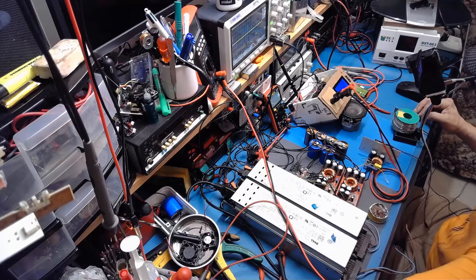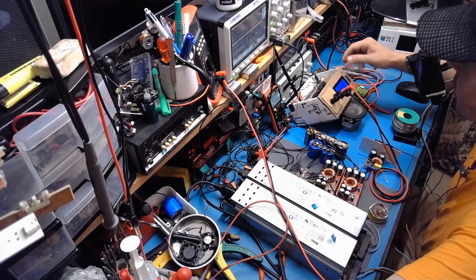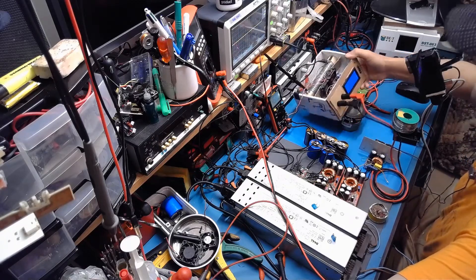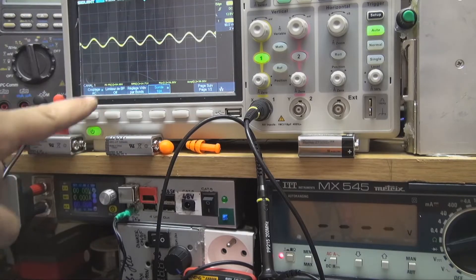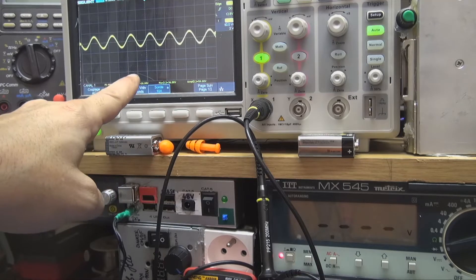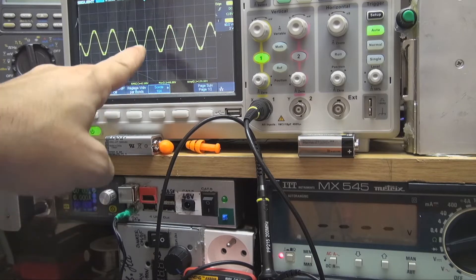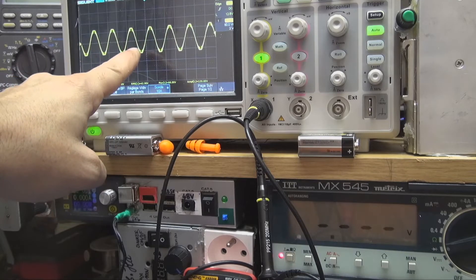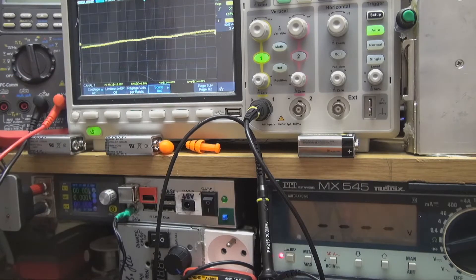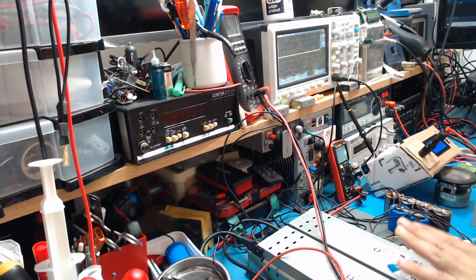To reset, decrease the sound. The heating element — the load resistor — is very hot. You can see the signals on the scope. Going to tell you how much power it is: 100, 200, 470 watts. You can see some distortion. You are at about 60 volts here — nearly 60 volts. And the power supply is protected again.